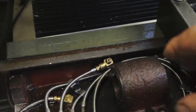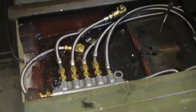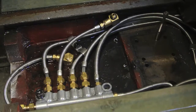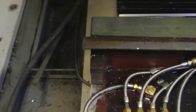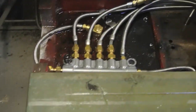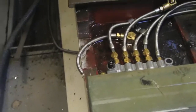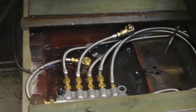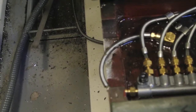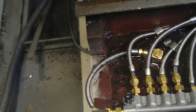Well folks, I gave up trying to adjust for the backlash in the system. I've come to the conclusion that the ball screw was worn out. So I've taken the ball screw out and sent it off for refurbishment. The reason is it's cheaper than buying new, and certainly cheaper than importing from the USA. Otherwise if I'd lived in the States I would have just bought new.